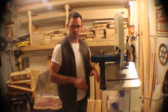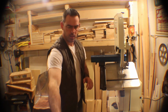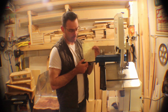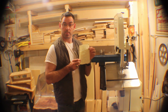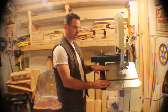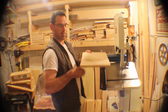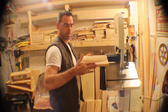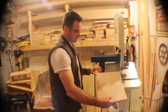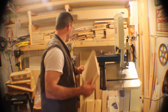The truck is basically a trapezoid, and I took some measurements on it, and it looks like in a rise of about 6.5 inches, it runs out about 3 inches, which, reminding myself of trig, comes out to about 23 degrees. So I've tilted this table to 23 degrees, and now I'm going to bevel the edges of this trapezoidal base at a 23 degree angle, so that when I mount the sides to this, it'll sit on top of that hump and straddle it. So the trick is to run all along the edge of this in this compound angle, and we'll see how that works.